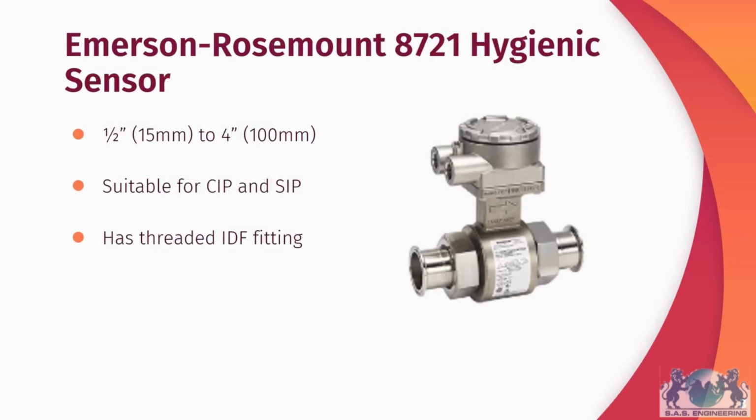For sanitary applications, you can have the 8721 hygienic electromagnetic sensor. It's available only in sizes up to 4 inches, but it is suitable for clean-in-place and sterilization-in-place applications. What makes it sanitary is this threaded IDF fitting, the International Dairy Federation authorized fitting. And in terms of weight, it's pretty similar to the wafer sensor. So if you have a DN40 8721 hygienic sensor, it'll only weigh about 2 to 3 kilograms.